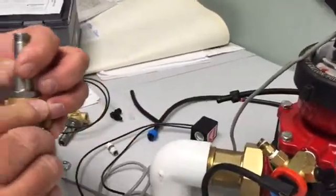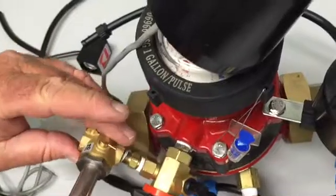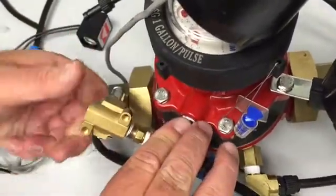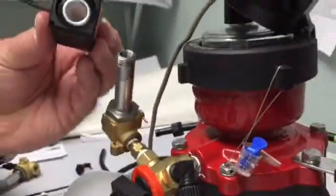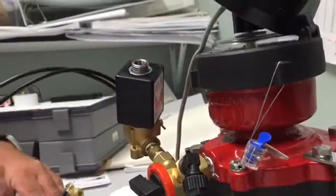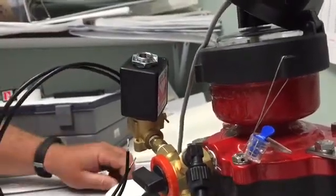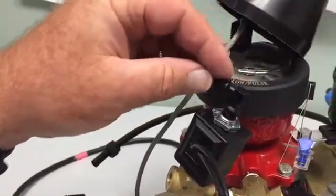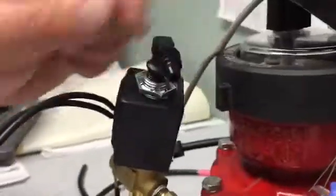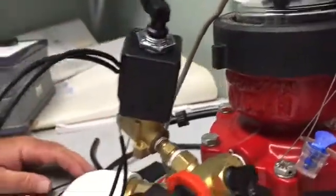We're going to put this back on, get our new normally closed base, and thread that back on there. We want to make sure that we do this slowly and that we do not cross-thread — if these cross-thread, we're in trouble. The big side of the solenoid always goes down, small side up. Slide that on, put your nut back on, then thread the little 90 fitting on. None of these plastic fittings need teflon — plastic to metal doesn't need anything — but make sure you thread this on straight, as this plastic piece will strip or cross-thread pretty easily.